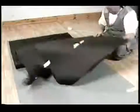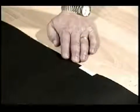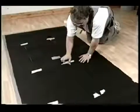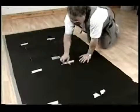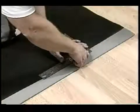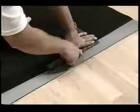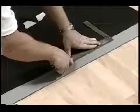Position the template on your next piece of material. Line up the reference marks on the template with the tape reference marks on your sheet. Then, use the previously cut triangles to tape the template into position. Using the straight edge used to set the measurements on the divider tool, you're going to trace the scribe set by tracing the installation area.